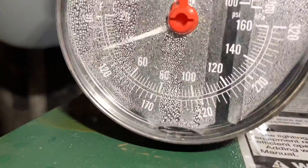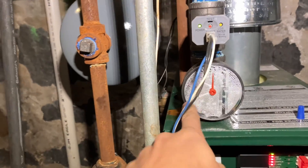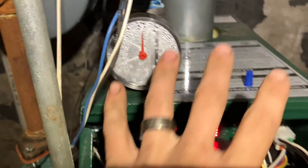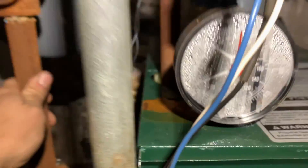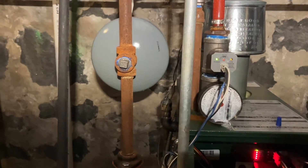Looks like we're going to be pretty good on this one. The boiler is still coming up, maybe 110, and it's been running for a couple minutes now, but I feel it's starting to warm up on the return — that's always a good sign. If the supply temperature hits the set point — in this case 180 — in like a minute or two, then you know only the water in the boiler is being warmed up and it's not circulating all the way around. The fact that it's taking its time to heat up means we have good circulation; warm water's going up, cooler water is coming down. Good thing I stopped and got that cup of coffee, or I wouldn't have been able to see the bubbles come out. Hope you enjoyed the video and I'll catch you in the next one.